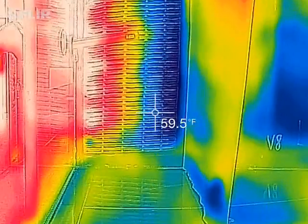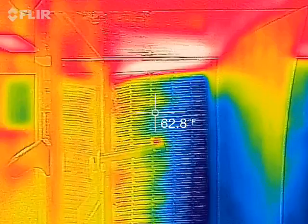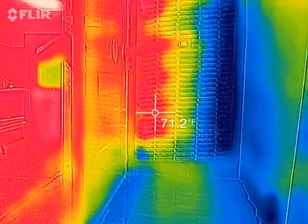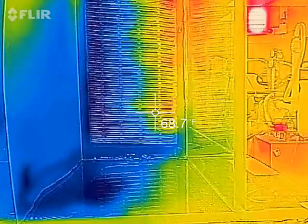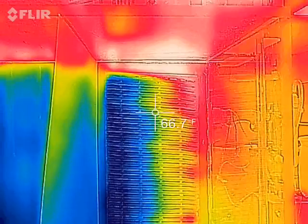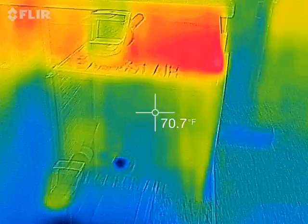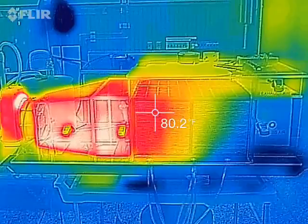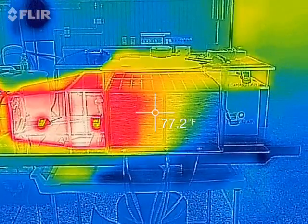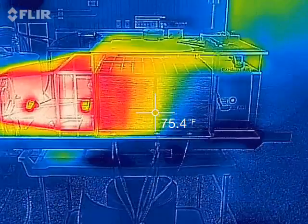You can see the center of the unit is much cooler, so there's a temperature distribution across the process air exit. That temperature right now is 68 degrees Fahrenheit, giving us about a 30 degree Fahrenheit temperature drop across this unit in desert conditions.